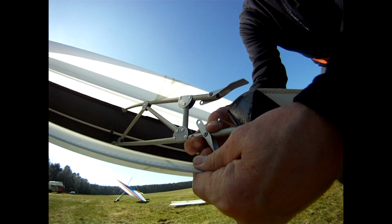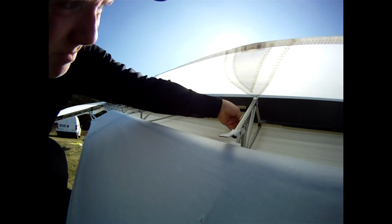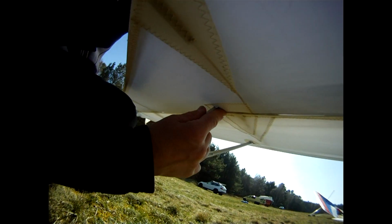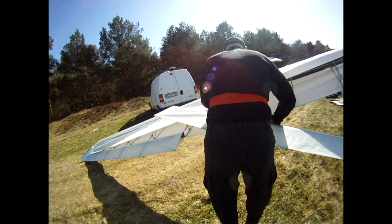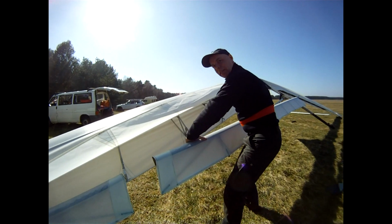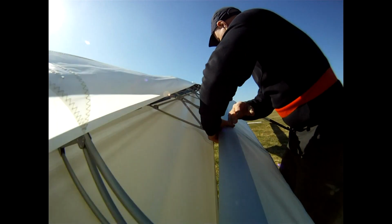And here the special axle and the special fitting for the final fixture of the aileron. And here the opposite side, the connection fitting and the securing sleeve, secured by a snapper. Pull the button, click. And now the connection at the end of the beam of the flap. The flap has a hole, and the axle of the aileron comes inside this hole.